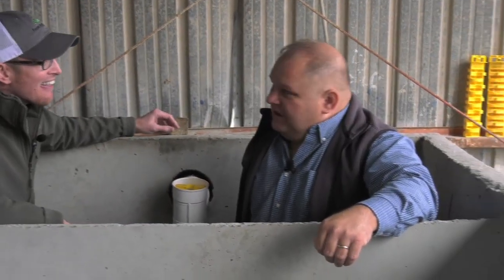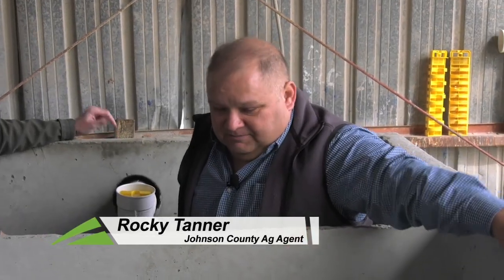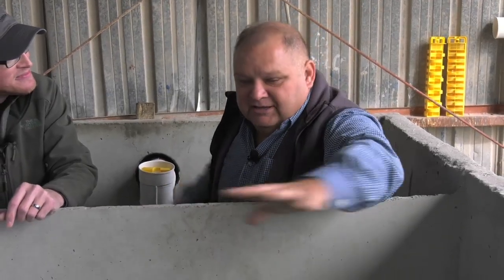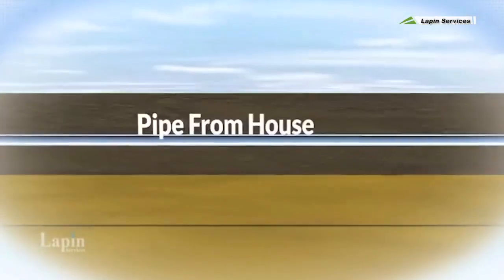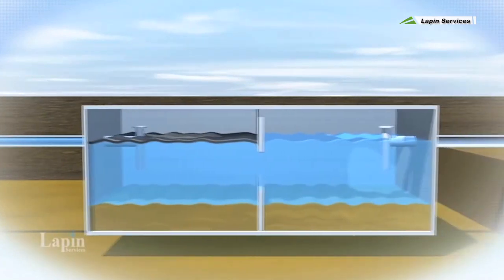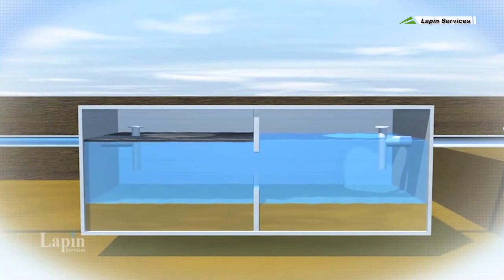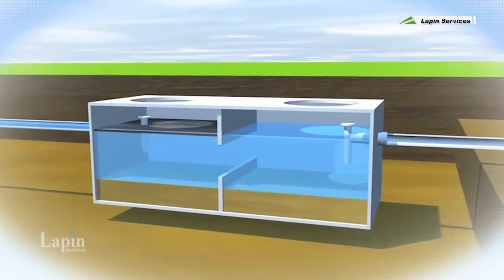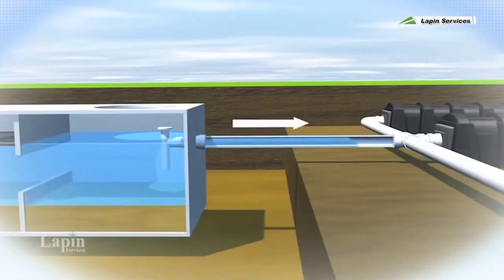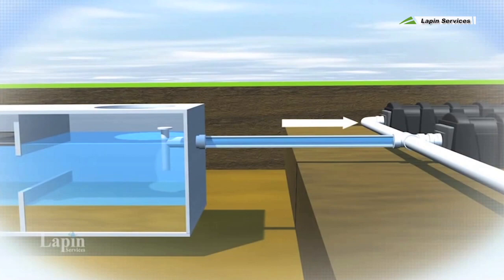All right, so we're looking at a 1,000-gallon concrete septic tank. The tank actually has a partition in it, and this is 2/3 of the capacity. This partition is supposed to compartmentalize 1/3 versus 2/3, and then we've got a pass through for the liquid to pass through to the second level, kind of like water falls over. So the water at this middle level is what technically comes through to this 1/3 compartment. And the solids are supposed to break down and stay in this compartment here. Only liquid comes through to this compartment.